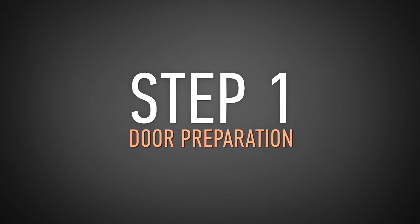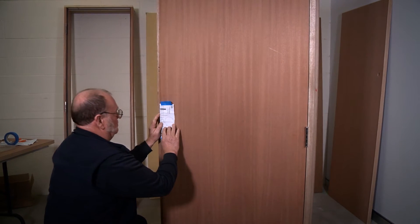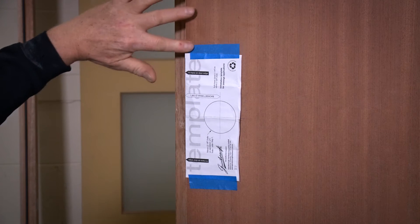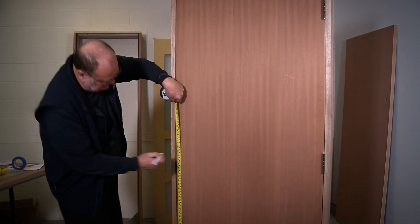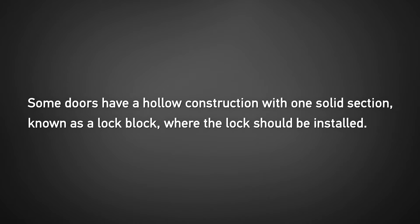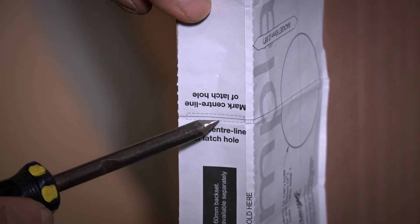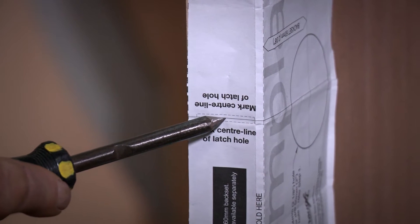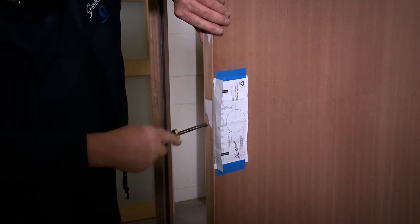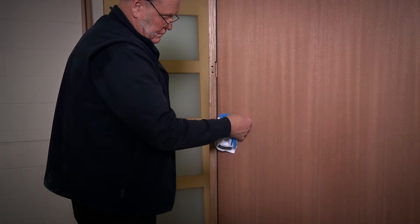Step 1: Door Preparation. For new installations, you'll need to prepare both the door and frame. Fold the installation template as marked and position it on the face of the door at your desired height from the floor using masking tape — normally around 1.1m. Confirm the correct height for your particular door, as some doors have a hollow construction with one solid section, known as a lock block, where the lock should be installed. Make sure the edge of the door is lined up with the dotted line on the template. Mark the centre line of the latch hole using a pen or screwdriver, then measure the door thickness and mark the centre point for the latch hole. Now mark the centre of the 54mm hole on the face of the door, then remove the template and prepare to drill the holes.